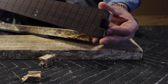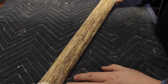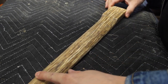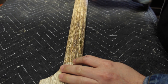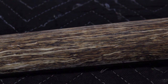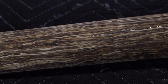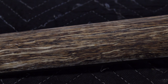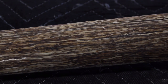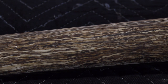Of course, this is now bonded to the wenge board, so it's not having that brittleness issue. I put on a first layer of epoxy on the back, all the way up to the heel, stopping at the headstock, and then sanded back. There are a few low spots — some sparkly, shiny little low spots — and that's fine. Those are the portions in between the hemp fibers where there were gaps, or air, or where the compression didn't really work when this was created. So when I carve that back, it exposes all those gaps between the hemp fibers. That first layer of epoxy is essentially just gap-filling or grain-filling.